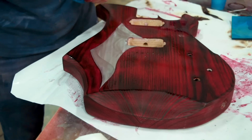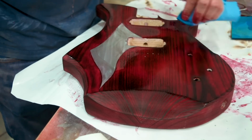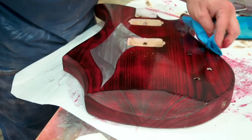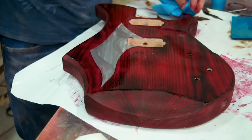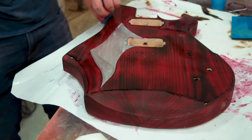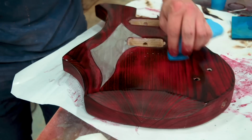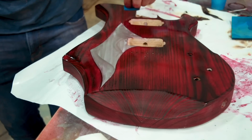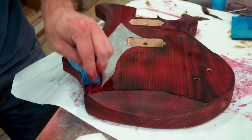It's going on relatively heavy so it can soak in, and the instructions on the can say do that. Put it on relatively heavy, wait, I think it's 15 minutes, wipe off the excess, wait 24 hours, steel wool, 4-0 steel wool or sandpaper to abrade it so the next stuff will stick, of course, and then reapply. And the gloss builds as you go. Keep on going until it's the level of shine that you want. That's how it works. I do it slightly differently than that.